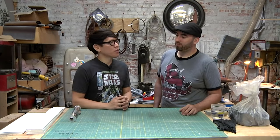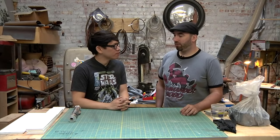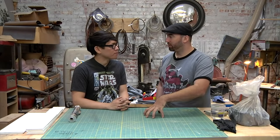So why would someone need to make a two-part mold? If you have something that you can't just glue down to the table and dump rubber on, you need to have both sides of it. And maybe you want it to open up so the piece demolds easier if there are little undercuts or complicated parts that you can't just yank it straight out.